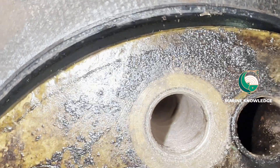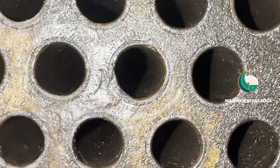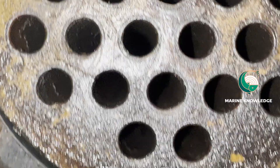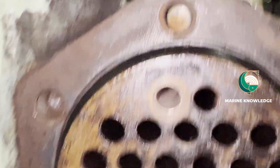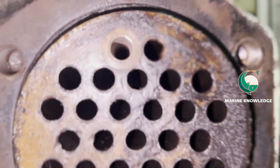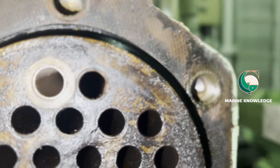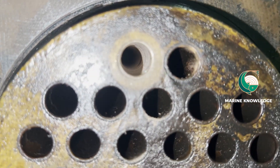What we need to do is open both sides of the cooler. You can see here — I'm zooming in a little bit inside. You can see one side is cleaner; the other side you can see black color — that black color is the coke deposit, which is not supposed to be there. That is what we are going to clean now. You can also see the o-ring which is on the top of the cooler.